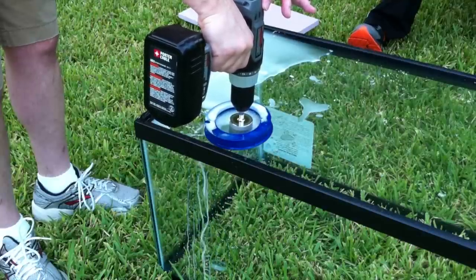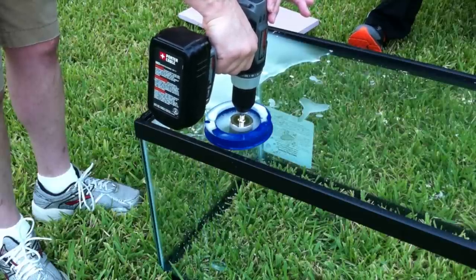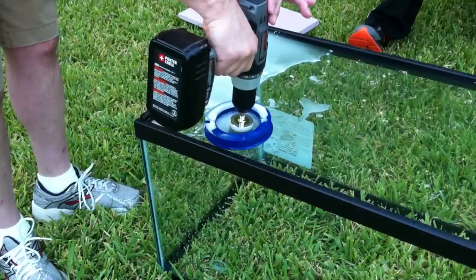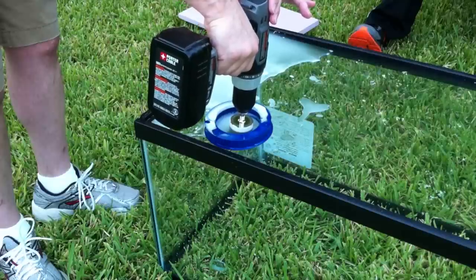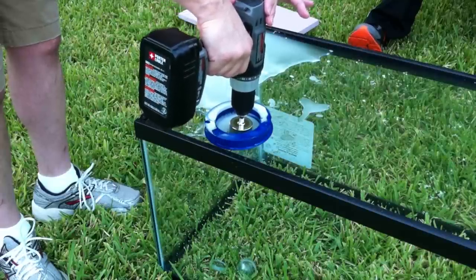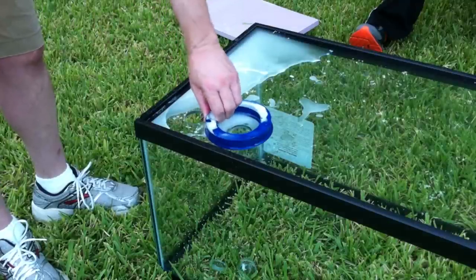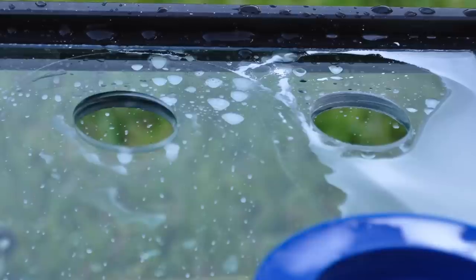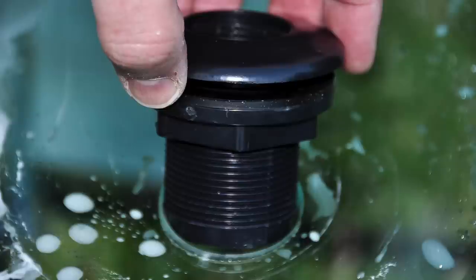We're about to go through. I can tell in this video that my drill is leaning a little bit — I got lucky, but it really should have been straight up and down. That's it — there's not much to it. The hole saw has to match the size of your bulkhead, and they're often sold in millimeters, so once you know that you'll be able to drill the right size hole yourself. Thanks for watching — a new video comes out later this week.